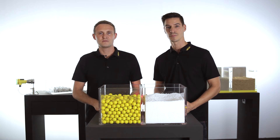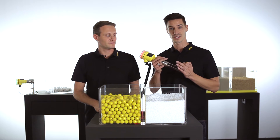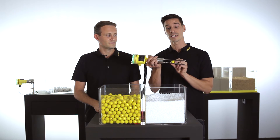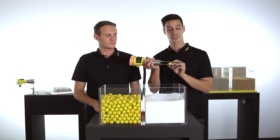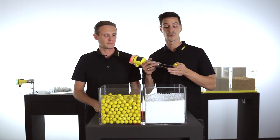If you want to detect extremely light bulk solids with a low density, we have developed our VEGAWAVE series 60 with the tuning fork design. The tuning fork can be blocked by granulated bulk solids, but the design makes it possible to detect light bulk solids like powder or, in this case, styrofoam reliably.